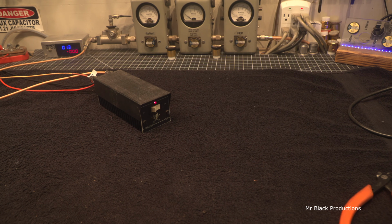The transistor's blown out of it, the protection diode's blown out of it, the relay capacitor is popped, the keying transistor is blown out, the relay is smoked. Both the power and the preamp buttons were in, so that means that everything was on, everything in it is junk. It's really honestly not worth fixing. It'd take more time than what I'd be able to sell it for.